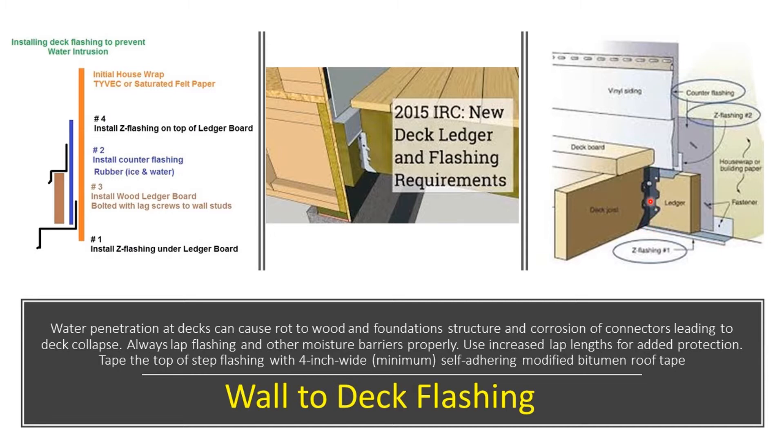We also should have joist hangers. Many times carpenters or deck installers will toenail regular two-and-a-half to three-inch nails — maybe hot-dip galvanized — into the wood. Once joist hangers are installed, every single hole should be filled with the proper fastener, which is usually hot-dip galvanized. We want to prevent any water damage from running down behind the wall, down to the sills, dripping back, and wicking up underneath the wood.